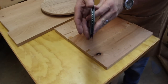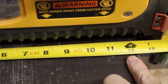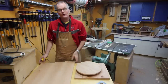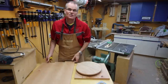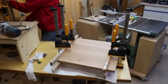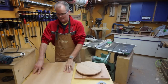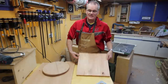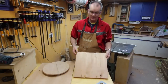There's a problem because my planer will only go up to a little over 12 and a half inches wide, and I need something 17 inches wide, so I've got a bit of a challenge. I've already prepared the stock, brought it down to finish thickness, and was very careful with clamping so it's nice and flat since I can't run it through the planer anymore. The base piece I'll probably make 10, 11, or maybe 12 inches wide so that can still go through the planer, and I'm doing that now.